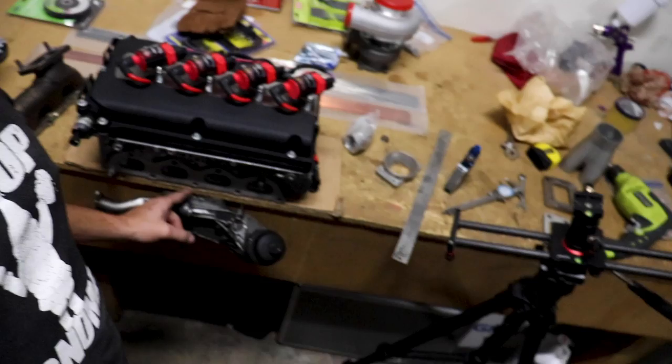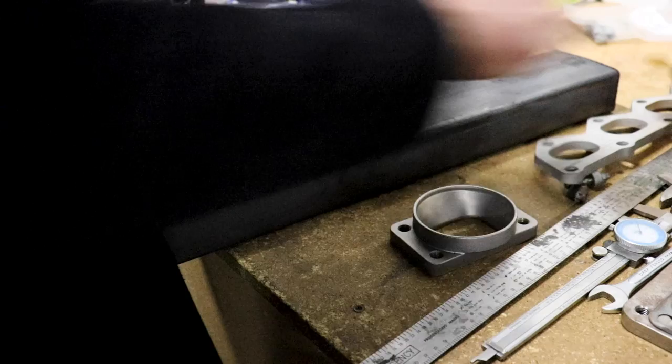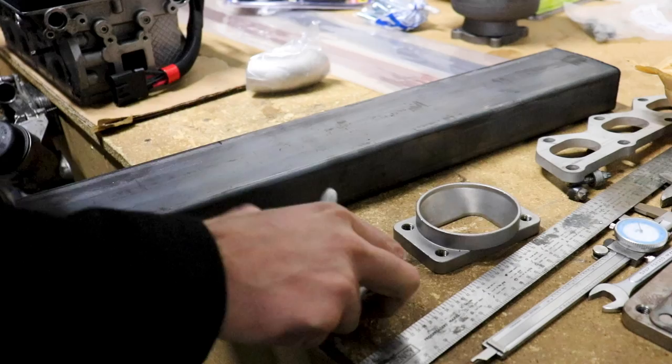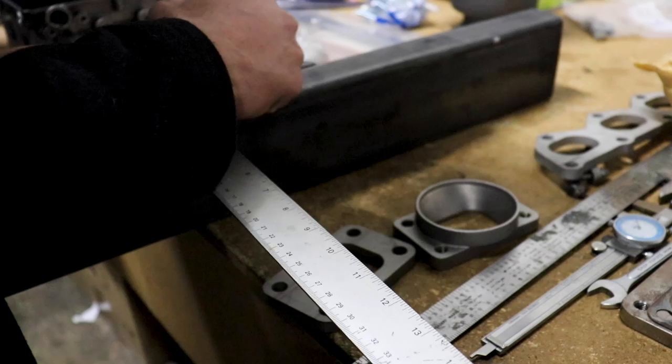What I'm going to do is remove this flange, cut down this collector, bolt the flange up to the cylinder head, and then take some of our one-inch stock and put it in its general location. I think that would be best. I want to cut this right about here - that will give us a section to mount up the flange, then our T3 flange for the turbo and our head flange. I'll take my T-square and draw that off.